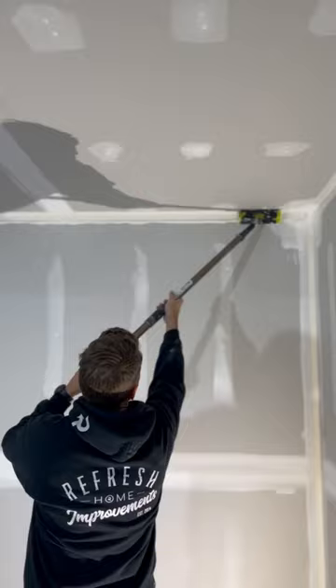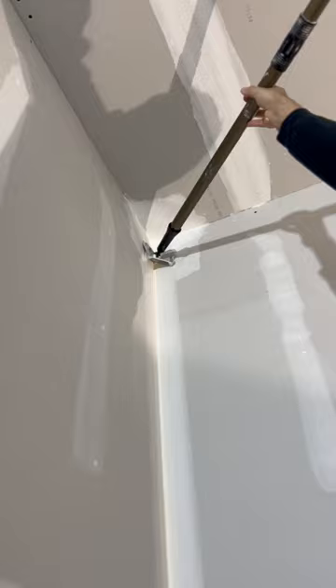The wheels help embed the tape into the mud evenly and eliminate air pockets or gaps. They hide imperfections in the wall to make sure that when you go to sculpt those corners, they remain 90 degrees. Essentially, they make the next steps of taping significantly easier. It also stops your tape from sliding around when you go to flush it.